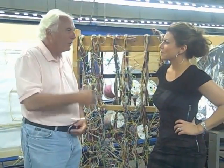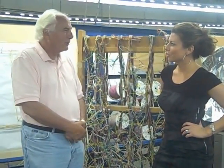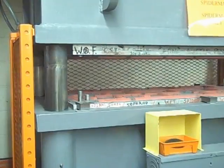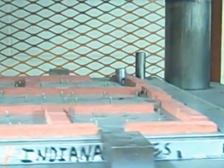We found it when we were starting our manufacturing, actually in early 1987, at a machinery dealer that we knew found it for us. The four-poster press has a bed of nails. It has plates we make for each game with these nails up top and bottom, and we're going to pinprick or put these nail holes in the playfield so the screws always go in the same place every time.